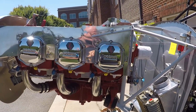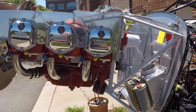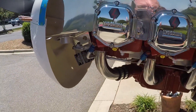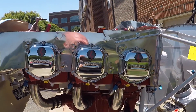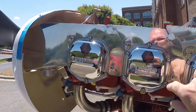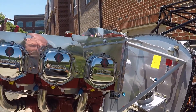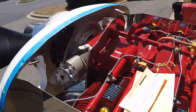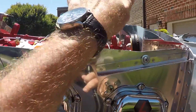I'm using the RV-10 firewall forward kit, which includes this oil cooler and its mount, as well as a baffling kit. It's nice to have the baffles pre-cut and the kit fits perfectly on the IO-540, but don't let that fool you — there's still a ton of work. Those baffles are on and off probably ten times before you get it right. That's probably a good week of work. Next up is the rubber, which will be pop-riveted in, so all the rubber will be in place.